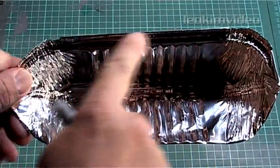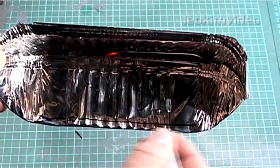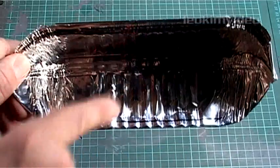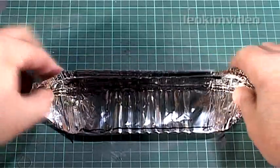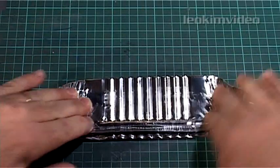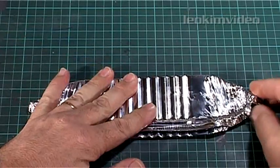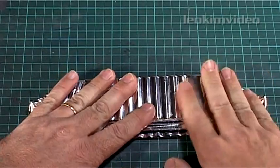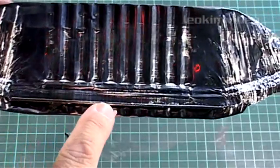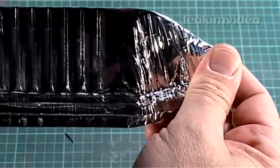The second fold involves folding the other side down, leaving a tab of foil exposed. Again, marking out helps in keeping the folds accurate. Ensure both ends are flattened out. The second fold needs a fair bit of flattening out. We're now dealing with three foil layers. Ensure this fold is well detailed. The tabbed edge will be used later to lock all the folds together and create a rigid edge.